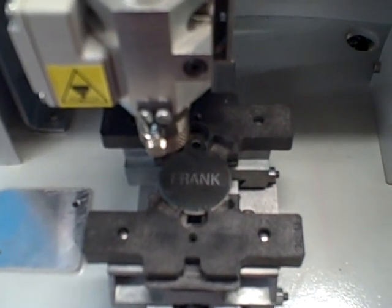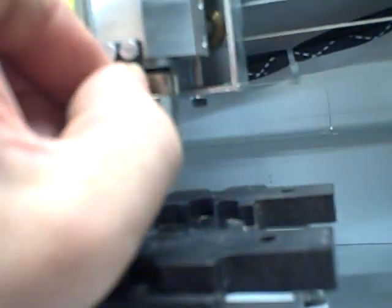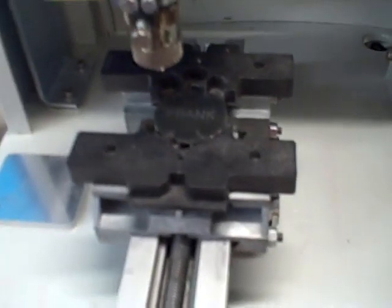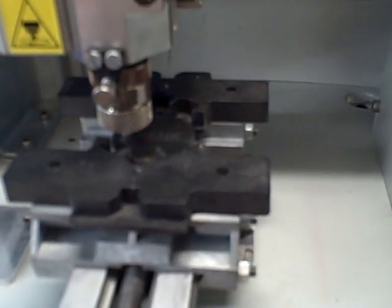Now if we want to go deeper — because you can really never go your full depth with one shot, the engraving cutters just can't take it — we'll loosen our thumb screw and bring this down a couple more thousandths of an inch. You only have to engrave about five to eight thousandths in depth to get a nice engraving. Then it's just a simple push of the green button again and it will rerun the program. You can actually hear it engraving much deeper than it did the first time.